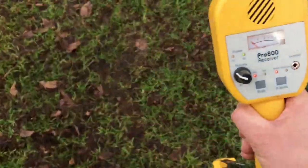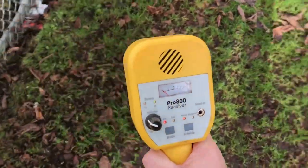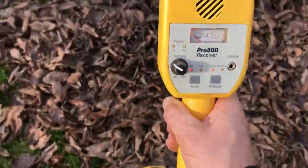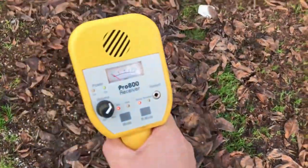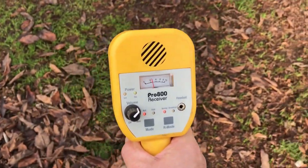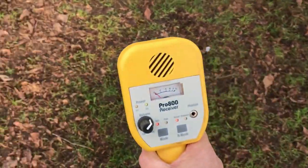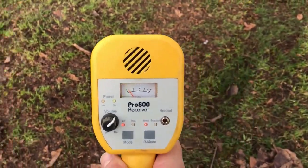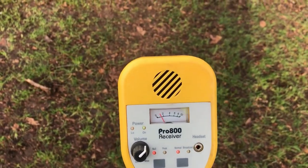Quickly you'll be able to discover which way the wire is going — walk one direction or the other and you should pick up some noise. Make sure you have enough volume. When you hear the noise disappear, bring it in, and when you hear the tone it disappears again. You can follow that or try to find each side of the wire. The noise is actually on the outside of the wire generally, and the silent area is where the wire actually is.